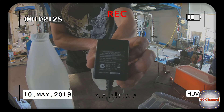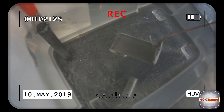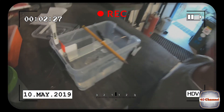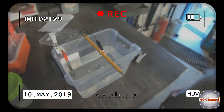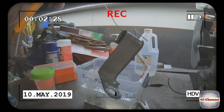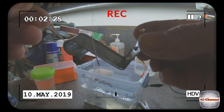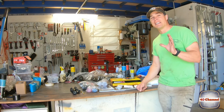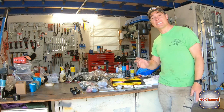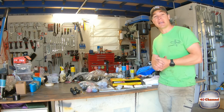12 volt, 1 amp. We're going to see if we can zinc plate this part. Straight away our part is bubbling. Smells gross. I think we've finally got it. So, I'm super happy with that. That's my first bit of zinc plating for the 40 series. It wasn't amazing, but it worked. Zinc plated some bits and pieces - they came up pretty dull, polished them up, and they came up quite nicely.